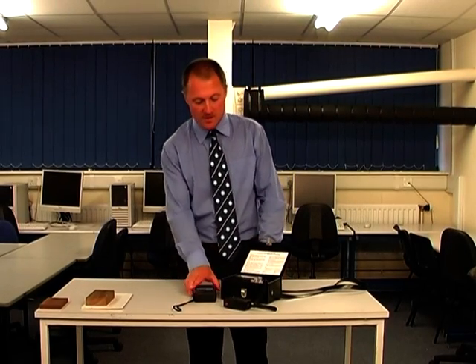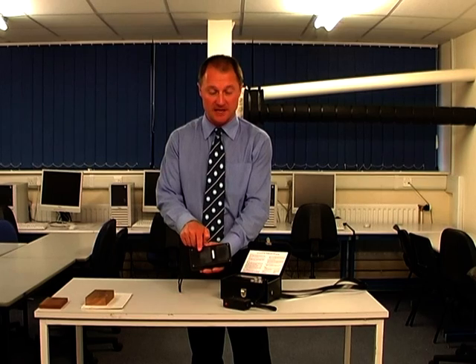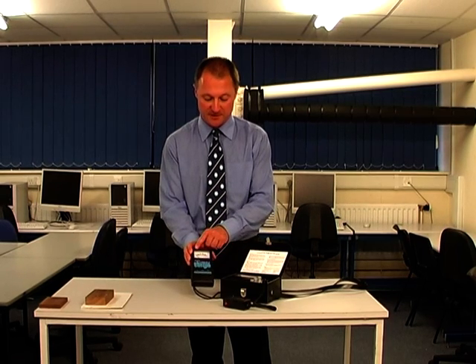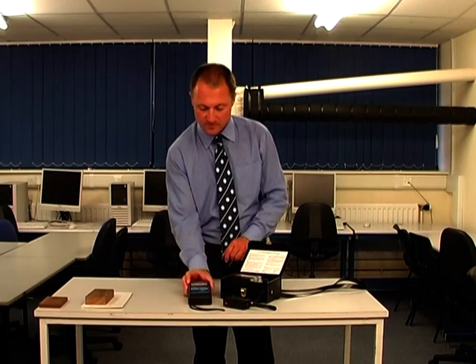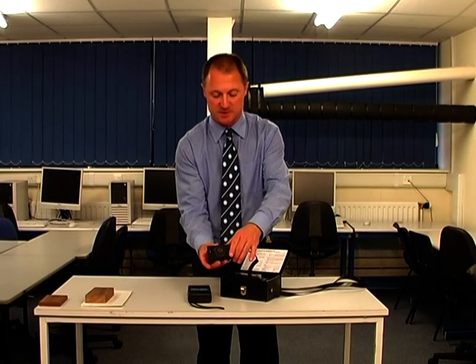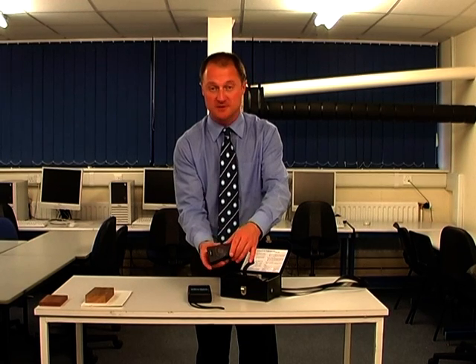Here in the lab, we're going to take a closer look at the two meters. Both meters operate on the same principle: they transmit a radio frequency from one electrode to the other electrode, then convert this information into a moisture content reading of the wood or the GRP on an analogue scale. The Sovereign uses a remote head with the same principle, but the electrodes are just simply much smaller. As we'll see later, this is one of its limitations, which can actually be used to an advantage.